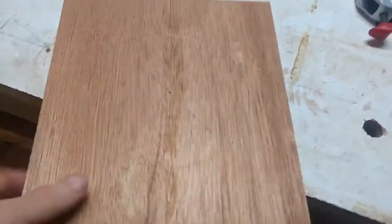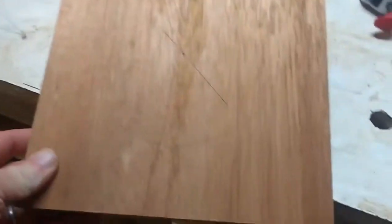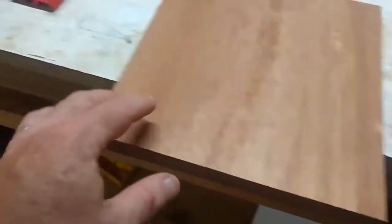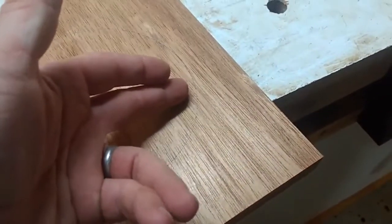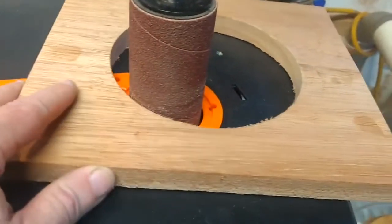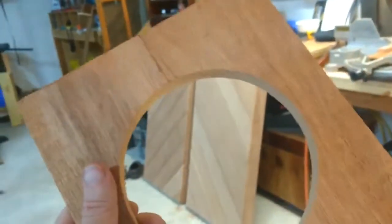Here's how I'm making my hole reinforcement — just taking another piece of mahogany that I've grooved up. I've traced that six-inch diameter circle with a compass. Basically you drill a hole, use your jigsaw, don't get right on the line but get close — about an eighth of an inch away. You end up with something like this, and then take it over to your spindle sander where you can really sneak up on that line and get a perfect circle. So we've got our perfect circle, and then I'm going to fix it to the bottom of the cornhole board.